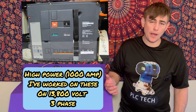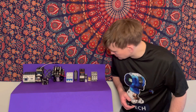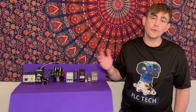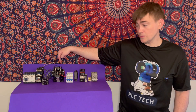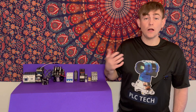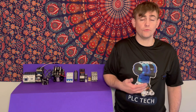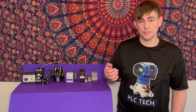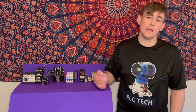The circuit breaker runs 480V 3-phase, but a lot of times we use 120 volts for the controls — meaning push buttons, running your PLCs, float switches, pretty much everything other than motor power. For controls, sometimes we'll take that 480 and drop it down to 120 volts using a transformer or a control transformer. Sometimes you'll also have a power supply that can take any input and turn it into 24 volts DC. 24V DC and 120V AC are common control voltages. You're not going to use those voltages to control motors and high-powered devices, so you need to step it down. A control transformer can break it down to 120 AC, sometimes 24 AC, or you can get a power supply that drops you down to DC.